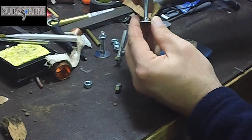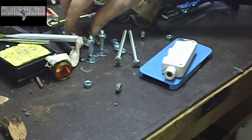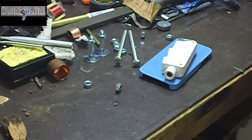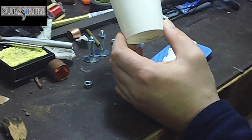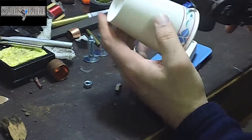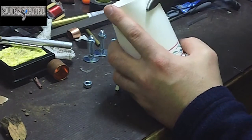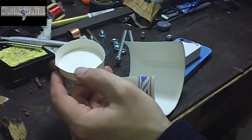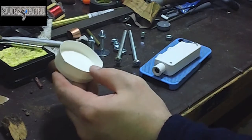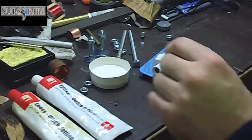I'm going to use these components in the future for making my own tripod stand. I've got about 20 projects going on at a time. Here's a little trick: take a plastic Dixie cup type deal, and use scissors or tin snips to cut it down. It's just about a perfect size for a mixing cup for epoxy — it also works for wood glue. I'm going to use some inexpensive generic two-part epoxy I got from Harbor Freight — not a sponsorship.